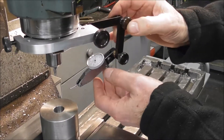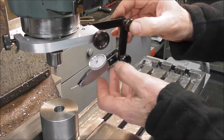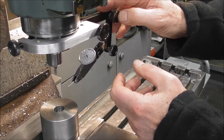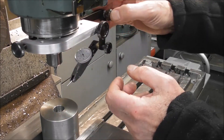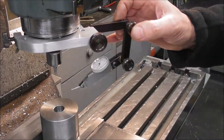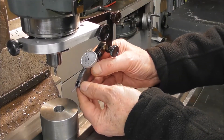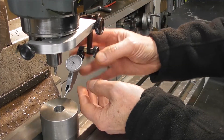I've always wanted to make one of these spindle mounted dial test indicator holders. They're available under the brand name Indicol — also called a J-frame type holder. They clamp very quickly and easily onto the spindle of the machine, and then you can adjust them to test your work setup with the dial indicator.